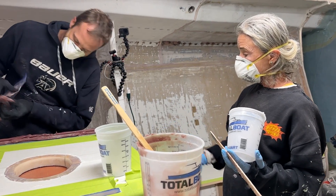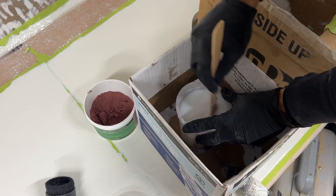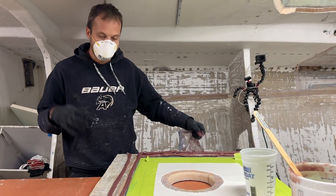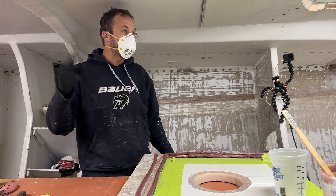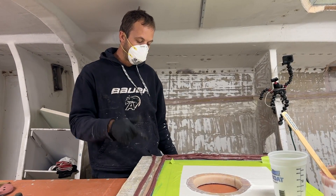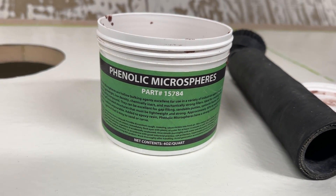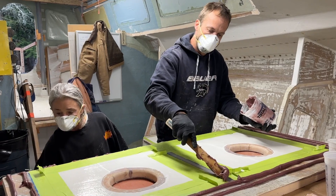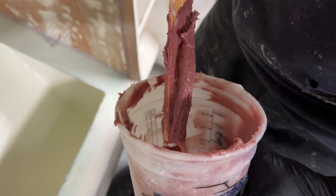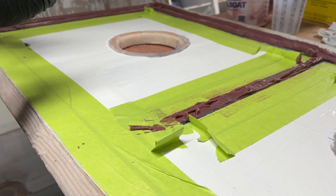What's the difference between the brown and the white? The white just has colloidal silica in it, which is like the strength additive — it adds a lot of strength. When you add a lot, it gets pretty peanut-butter-ish, pretty thick. But when it warms up, it still tends to sag off. So I add this purple stuff, which is micro bubbles. It's for fairing mostly, so it makes it really light, but it also helps keep it from sagging even more than the colloidal silica does. It just makes it so once we glue it down and the epoxy starts to warm up and want to slide out of the seam, it won't slide out as easily.